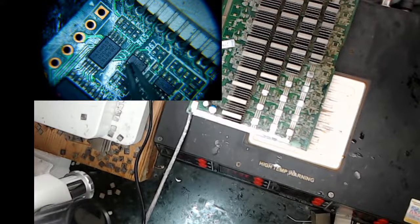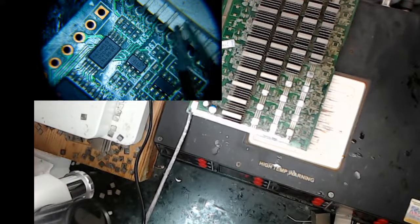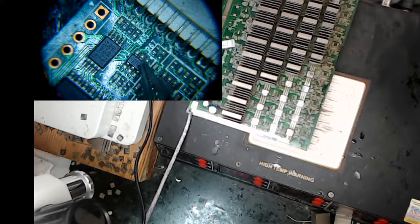It takes a signal, two signals, if I'm not mistaken, a signal can run through here and run through here. These two paths basically go to the control board through the connector right here. So you've got something like, I want to say 3.2 volts over here, but this is RO, so it's 1.8 volts. So this chip lets you communicate binary, the I2C communications. There's binary signals being sent back.